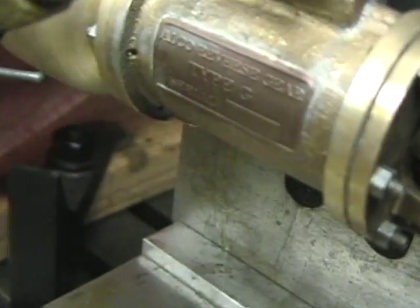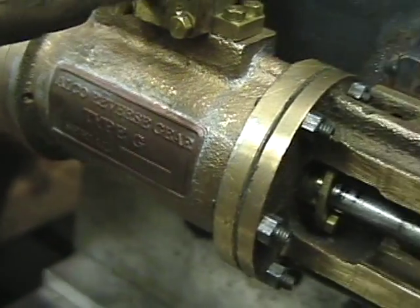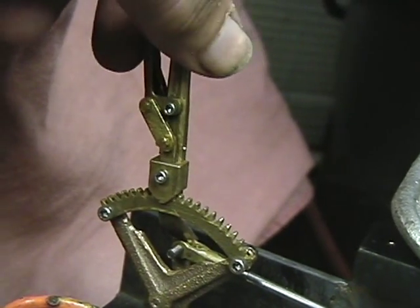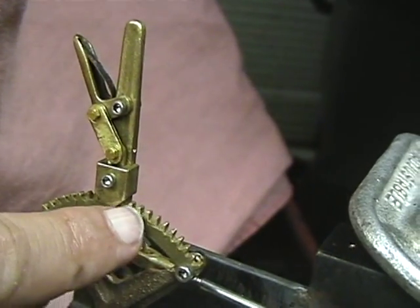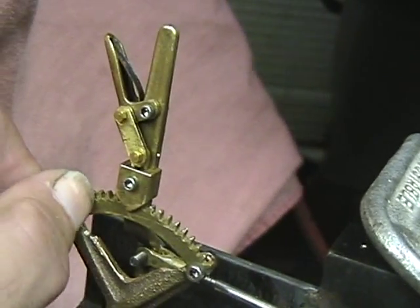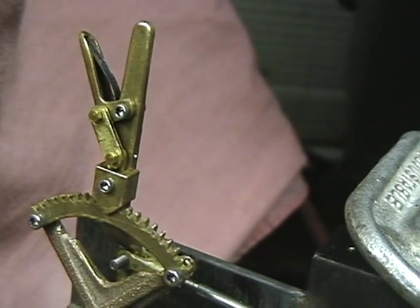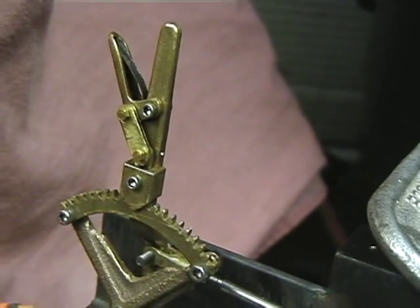This is the copper etched plate that I made up — I'll cover that in a different video. Here's a close-up of the quadrant. The part up here is spring-loaded and moves along there, and there's a segment of gear inside that meshes with gear teeth to hold it. On the prototype these were squared notches, but I happened to have a big clock gear that someone gave me, and I cut a segment out of it and used that as the quadrant, which works fine.